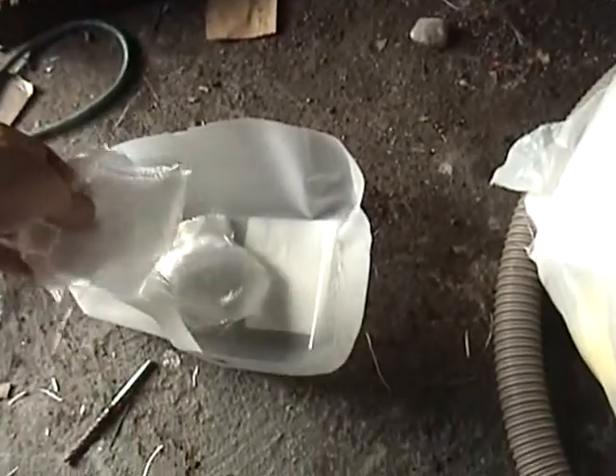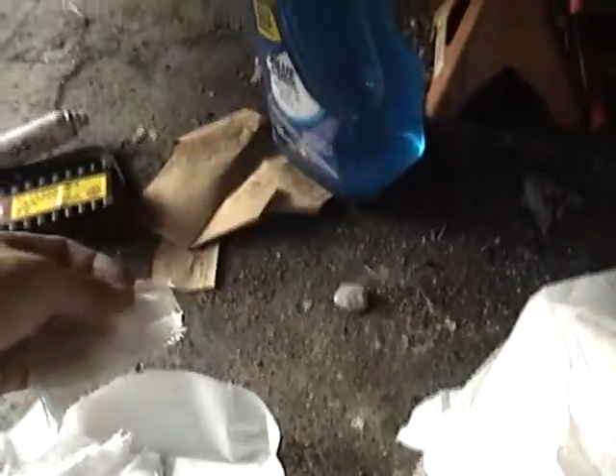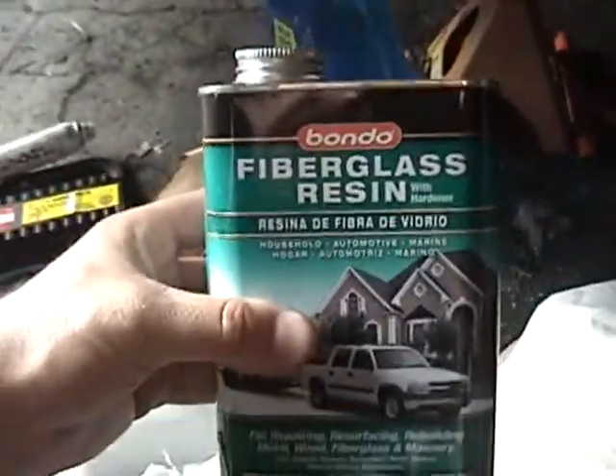Just wanted to take a quick video here before I went any further. In order to do fiberglassing, first you get fiberglass sheeting and you cut out the size you need roughly. I actually have a couple of squares here that I just cut out, roughly the right size. One or two of these should do just fine. Then what you do is you mix up the fiberglass resin with the liquid hardener, according to the ratio on the package.